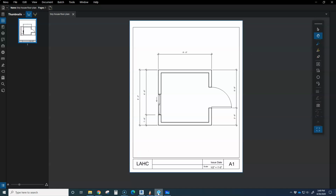If you guys go to the module, there's a floor plan link, and this is a file you're going to get. So this is the actual floor plan of your framing model. So your walls are going to be finish to finish or stud to stud, 8 feet this way and 8 feet this way. You're going to put in a 3-foot door, 2 foot 6 away from the corner, and then you're going to also put in a 3 by 3.5 window, 1 foot 6 away from the edge. So I will update the size of these windows and the doors on this floor plan.